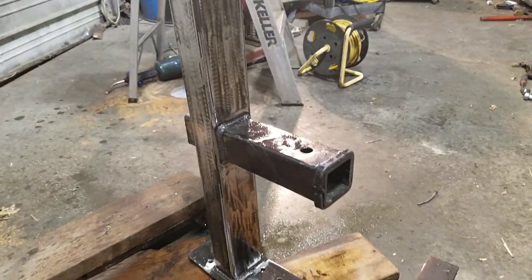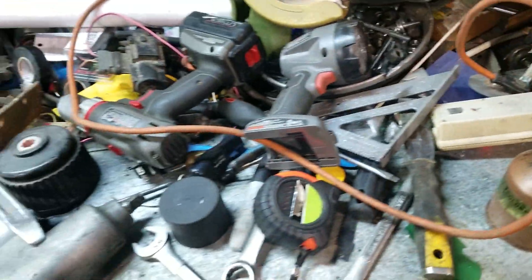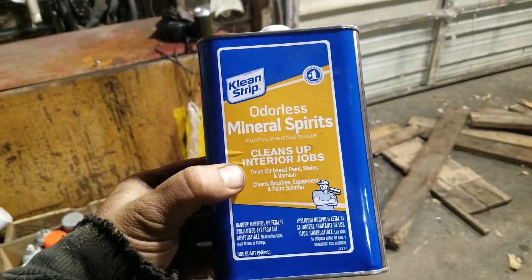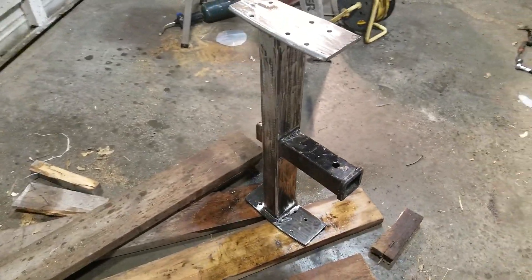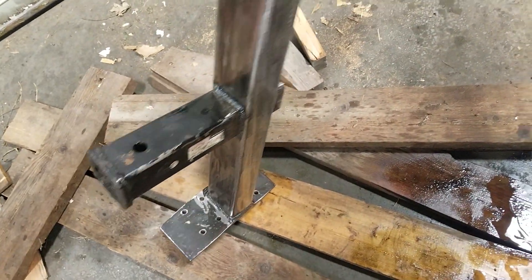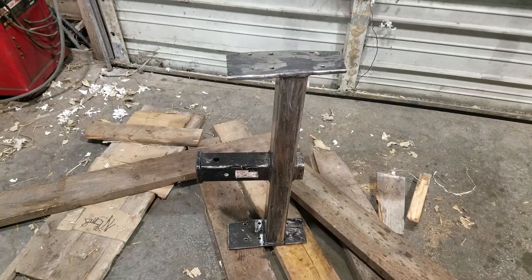I took the flap disc to her so I can throw some paint on it. I don't usually put this much effort into painting, but tonight I did. I've got a little trick for cleaning things after I flap disc — take one of these siphon air guns, stick it in a bottle of mineral spirits, spray her down, then spray it back off with air. Right now what's on there is actually ether — spray her down with ether afterwards and it will be clean. It'll take paint real well.